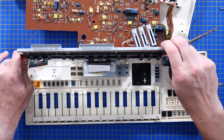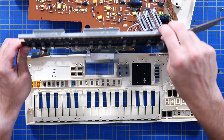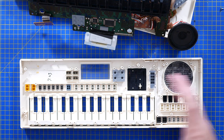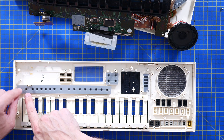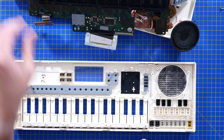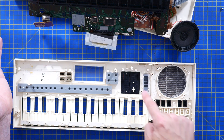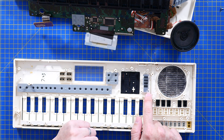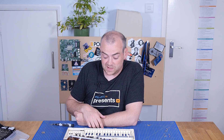We had all those wonderful screws all over the place. This little interface board appears to be double-sided tape. Hopefully that screen is just going to lift out without falling to pieces. So this is the back of all the buttons — they are largely membranes. You see all those carbon or graphite pads on the back of the rubber that just make and break on various traces on the PCBs. They've used that everywhere — even the sliding power button is based on graphite pads on little acetate type transfer paper. That would wear out really quickly. If you have one of these with a bad power switch, there are pens that will refill that graphite coating — you can even try going over it with a very soft pencil.